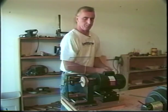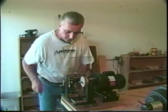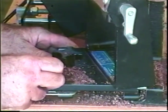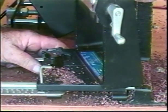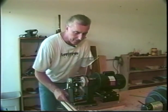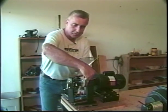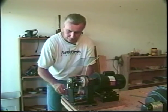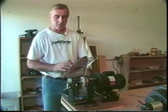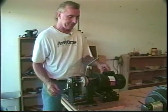Now that we've got the vertical piece cut, we want to change the angle back to our 19 and a half degrees. When you slide this in, the blade that's cutting at the furthest outside will be on the inside, and you want that aligned up right where it's going to start cutting at the edge of the wood — there should be a hole there for the index pin to fall into on the index plate. So really what we're doing is changing the rest of the stock from a zero degree angle to a 19 and a half degree angle.